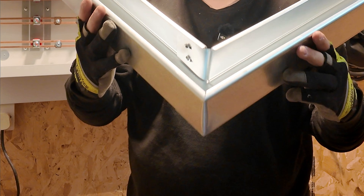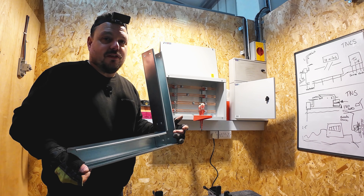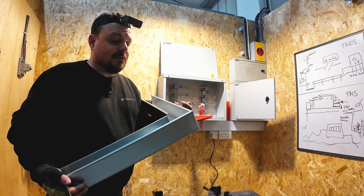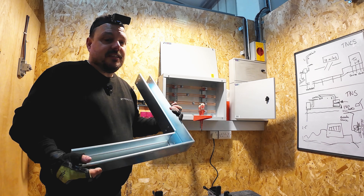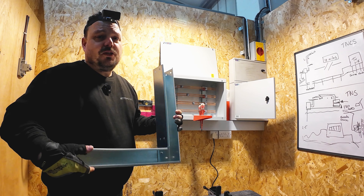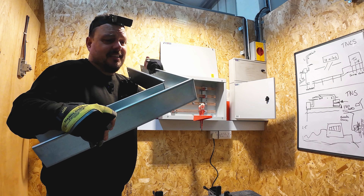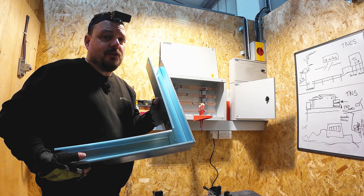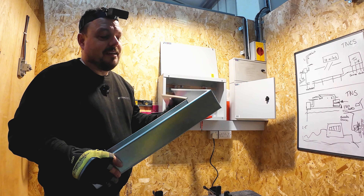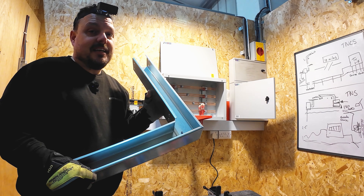Obviously you can use your manufactured joins, but it's nice to have a bit of fun from time to time. I hope you found that a useful video. You need to make sure that your edges are all safe, that you are not exposing any cables to snags. When using those rivets, make sure your ends are smooth — usually they bend over into a little mushroom with no sharp edges. Also position your fixing holes in a way that cables won't be lying on them, and ensure you've got that rigidity and strength — this is absolutely rock solid. If you've got any questions or tips, please drop them in the comments below. Thank you very much for watching and I'll be back again with some more content soon.